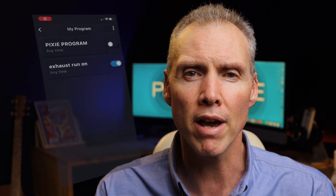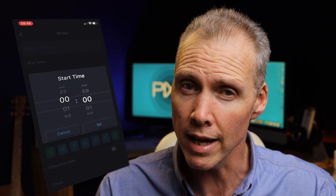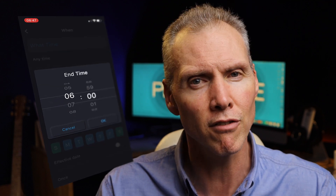There is a new feature in Pixie called Program, which is a conditional logic program. We'll relate these back to the sensors to give you some ideas of how it could be used. Using the indoor sensor with a PIR in the hallway — as you walk out of the bedrooms adjoining the hallway the lights come on. One cool thing is you don't have to connect a load; using the Program function you can send a message to any other Pixie device when that sensor activates or deactivates. For example, create a program so that if the sensor sees motion between 10 PM and 6 AM Monday to Friday, then turn the hallway lights to 10% because there's a Pixie dimmer in the hallway.